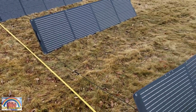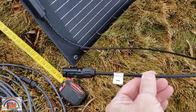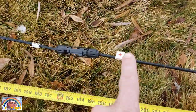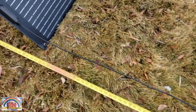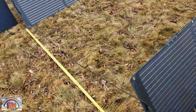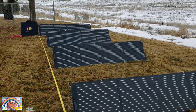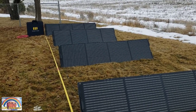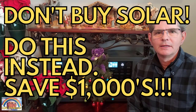These four panels connected here take up 20 feet of space on my lawn. Each panel comes with a negative and a positive cable, and you're going to set these up in series — connect positive to negative. There's only one way to do it; you cannot do it wrong. Then go to the next one and keep that string going. One thing I really like about the Mango is that you can get 2,000 watts of input power per hour to recharge it, making it a very fast-charging power station. If you haven't seen my full review of the Mango Power E station, click the link below in the description.